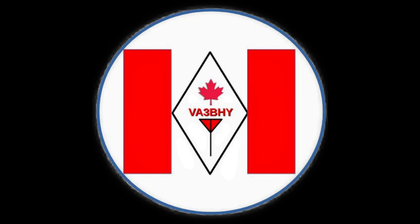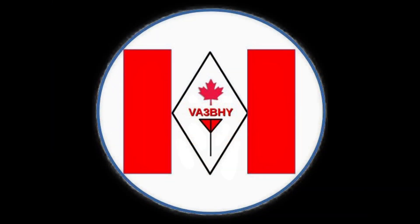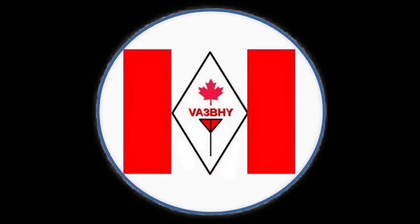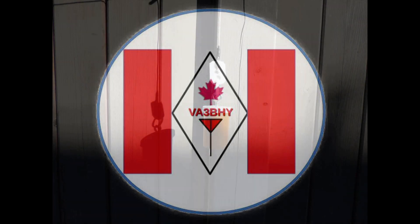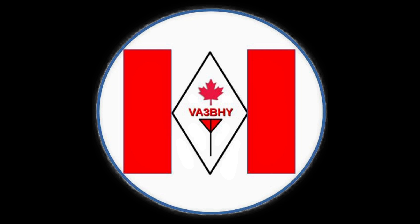Today's video is version 3 of my antenna build for small backyards, using a 71-foot random wire antenna with a 9-to-1 unun and 1-to-1 balun. The wire I used for this antenna project was speaker wire, gauge 22. The changes I made on this video are the following: I lifted the antenna wire off the gazebo roof, I added wood balls in two places, I added a counterweight to minimize wire sagging, and at the end of this video I will show the new SWR results after the lift. So, let's begin!